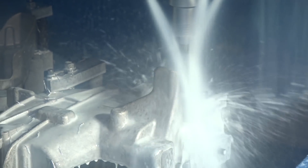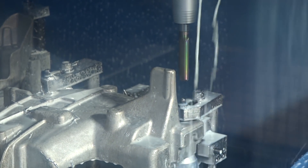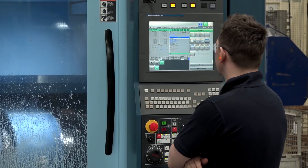How do you handle that light cut of casting when it happens and you almost feel like there's a little bit of chatter there? That can have an effect on the spindle and tool life. How do you manage that machining? Well, a lot of that's down to the workholding. With us now designing and manufacturing the workholding in-house, that allows us to look at those scenarios, look at the tooling selection and design around that with the workholding. And do you not worry about spindle wear as it's kind of deflecting? No — on the Matsuras themselves we've got extremely good reliability. We've had no issues with those machines in any of those scenarios.